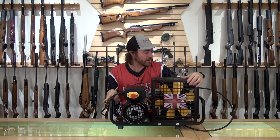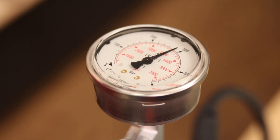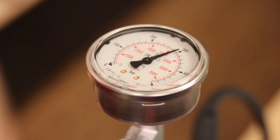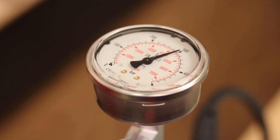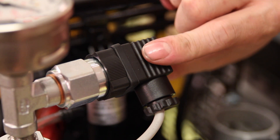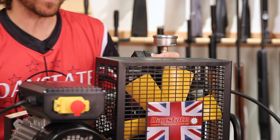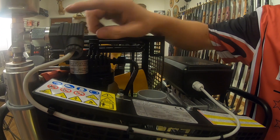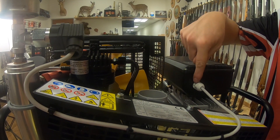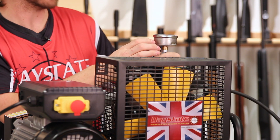Starting at the top — you have a nice large, about two-and-a-half-inch glycerin-filled gauge. The unit vibrates a little while it runs, so the extra fluid keeps your needle still and gives you accurate readings. Right off the neck of the gauge, this little black box with the wire running to it is the auto shutoff. This unit does have an auto shutoff set to right at 4,500 PSI. When you're running your compressor, you don't have to worry about going above 4,500 — it will send an electrical relay and automatically shut off the unit. Anytime you're going up to 4 or 5,000 PSI, that's a great fail-safe.